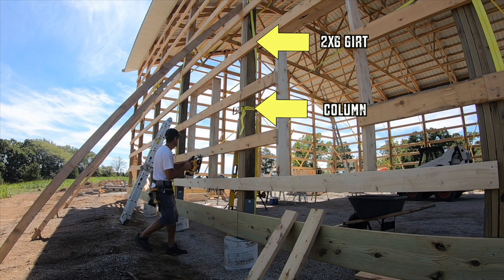There is three inches in most places between the wall girts. If you're familiar with a post frame home, you have posts and then two-by-six girts that go along the outside. In between those, the spray foam is three inches in most places, but where those wall girts are it goes down to what should be an inch and a half — but in most cases it's an inch, and along the bottom it's half inch or three-quarter inch. There were also screws that weren't covered, so the cold was driving through those metal screws and creating frost balls.